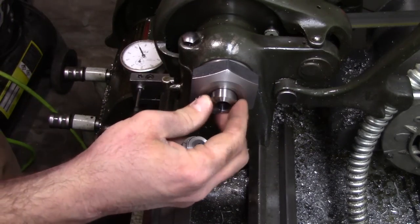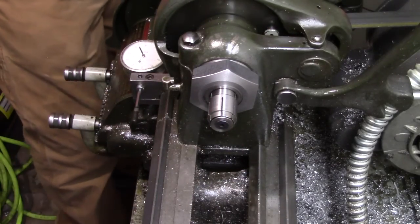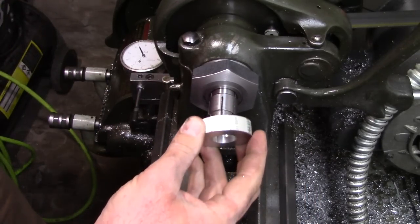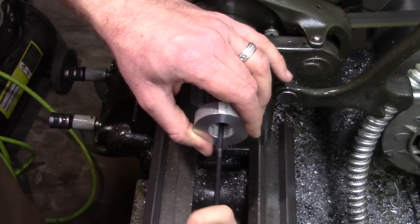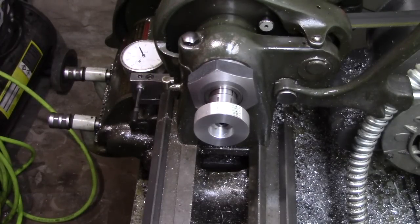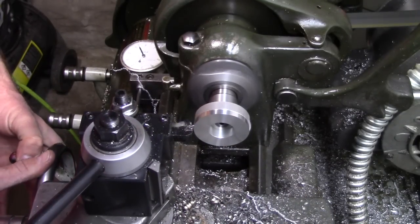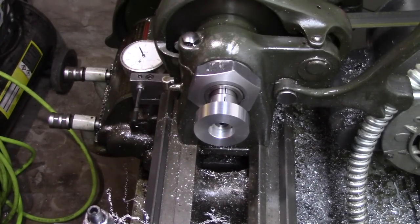All right, we're set back over here at the lathe. Got my half inch collet. This will slip right in. And tighten it down. Now I can take my part, push it up against that register, and tighten it down. Now she's held in tight. Let's make a test cut on the perimeter, see how it works. She works a treat. That'll do it for this episode.